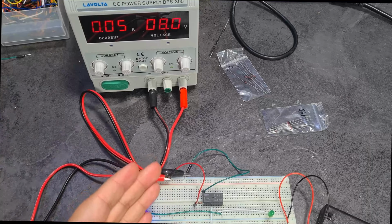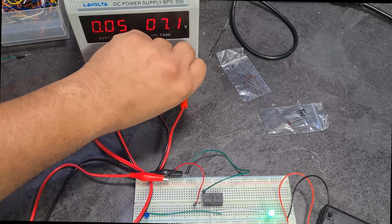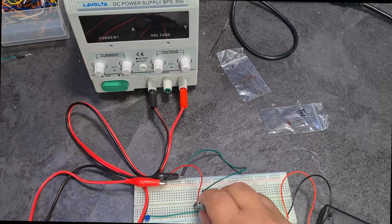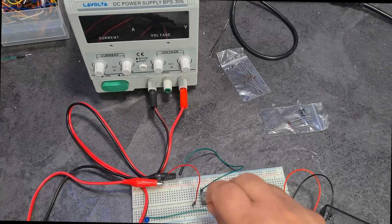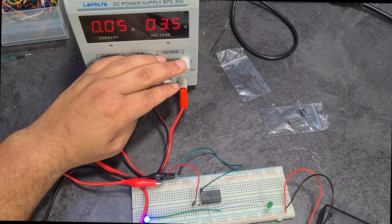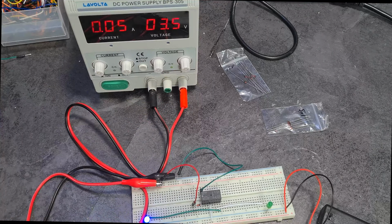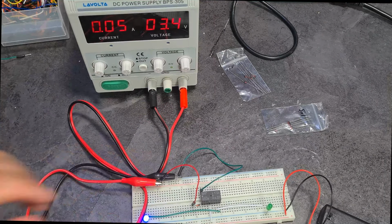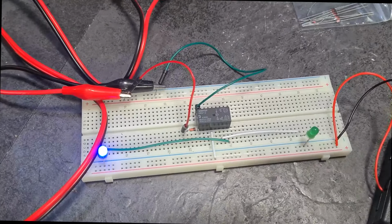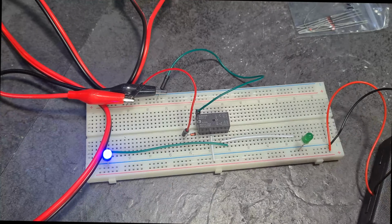And so you basically got to think, okay, how can I drop the voltage down? And I thought I was getting a bit crazy, so I said to myself, look, maybe I'm putting the Zener diode in backwards. Let's turn it around. So there, at 3.5 volts, it starts conducting. So here now, the Zener diode is just in the position to allow, it's forward bias, right? So it's literally just letting current through anyways.